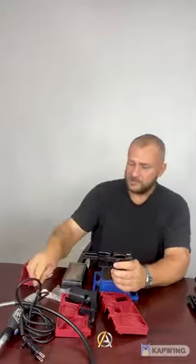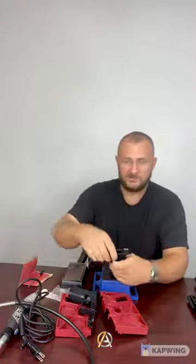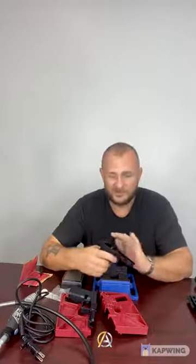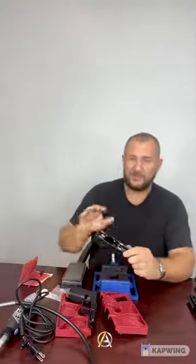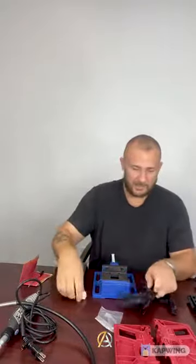What you're going to need the Dremel for is this area where your trigger bar goes. You're going to need to polish that polymer inside. And at the same time, you're going to need to polish the trigger bar. Make sure that it's got a nice mirror on it so it's smooth, it's gliding, there's less friction. And that's going to be one of the big issues if you don't, is that friction that's going to give you a little bit of a harder pull. So that's what this is good for with the Dremel. You can actually do the trigger bar on a polishing wheel.